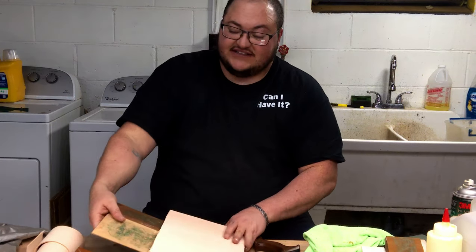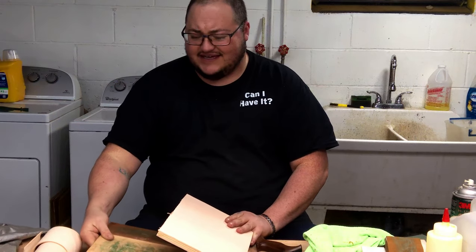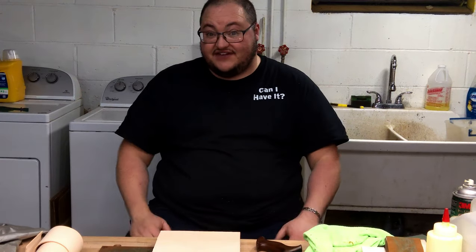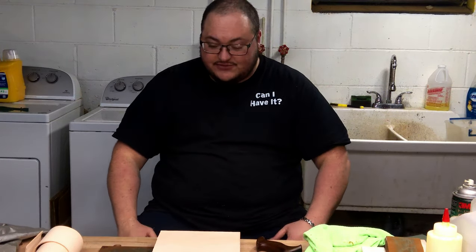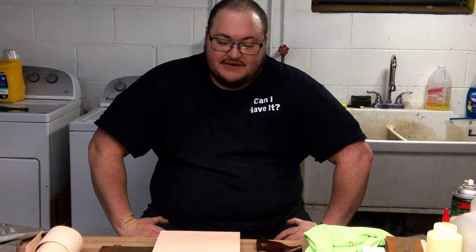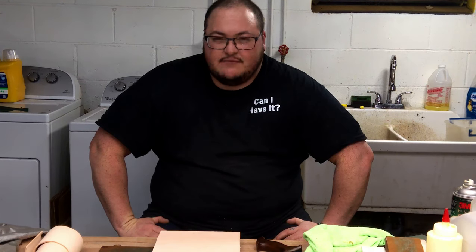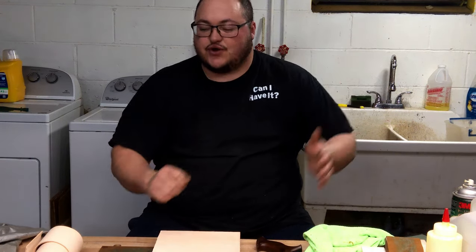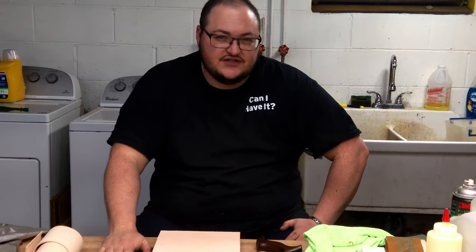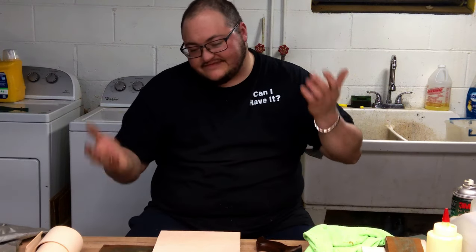This piece of glass, this isn't float glass. This is left over from, I think, a china cabinet or something like that, that I kept the glass out of specifically for this, and then if I wanted to build picture frames or something. People say float glass because it tends to stay flat more, but if you're going the glass route, I can't imagine you're going to be holding the glass in the air and stropping. You're going to have it on a flat surface. So if it flexes, it's flexing onto a flat surface, especially if you're clamping it down. So that's kind of up to you.